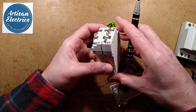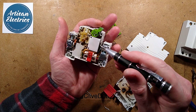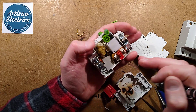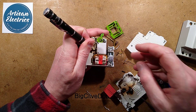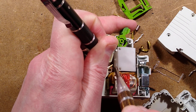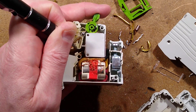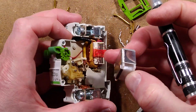The RCD detection bit must be the other side - there's the sense coil. This module inside also has the ability to trip. There's a wee pin here, and if I hold a magnet close to this, that pin should fly out. That little plastic pin on the end of the box, like a little tiny solenoid - hold the magnet near it. Did you see it just kick out there? That is the mechanism that trips it when it detects the current imbalance. Push that in and it resets and latches. It's actually completely removable, which is nice.